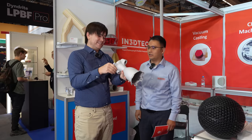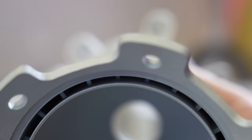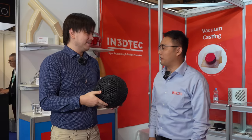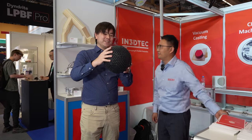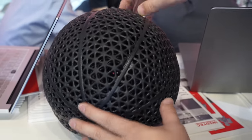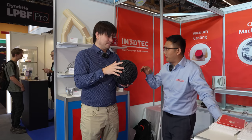Is this a rocket? Yeah, it's got like that converging-diverging nozzle, and there's a bunch of internal cooling features here, so it's a really hard geometry to be able to produce. What material is this made out of? It's printed by SLS printing. This is like a double-walled lattice structure, so it seems really sturdy and it's nice and bouncy. It's just to show the customer that SLS can print very complex parts without supports.